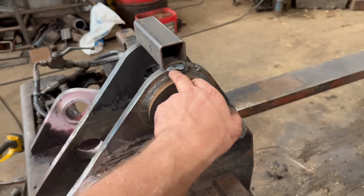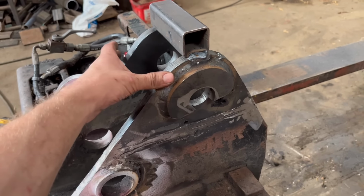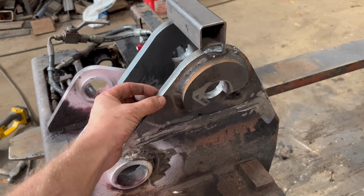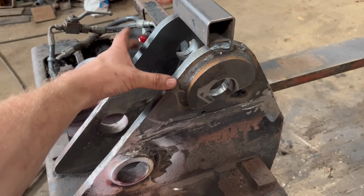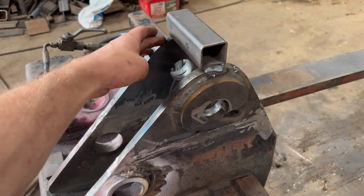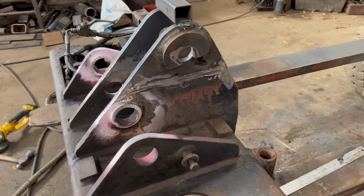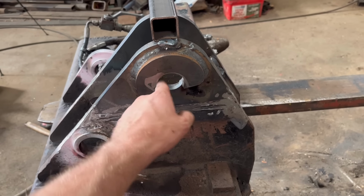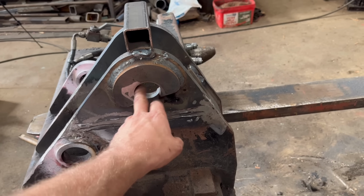So before I do that, I'll just cut through that weld, release any pressure off here, and then I'll weld it back on again, because it's only thin, they can vibrate and, you know, end up ringing. So if you have some welded from one to the other, it seems to stop them doing that. So it's plasma cut out of 45 mil, and they need to be 60 mil. So there's a good amount to take out.